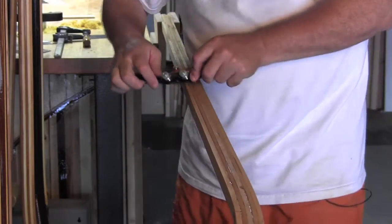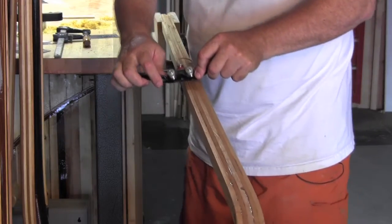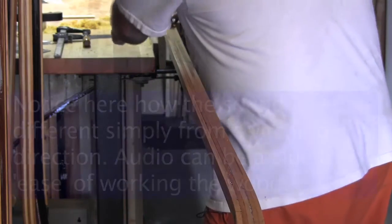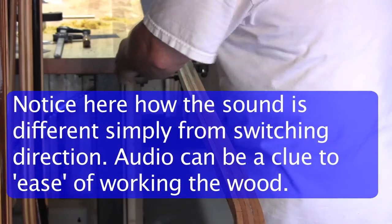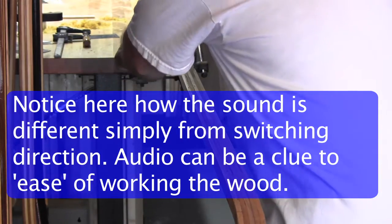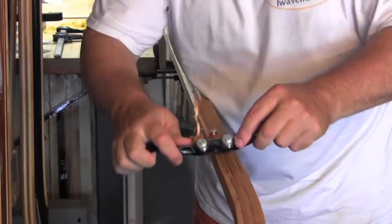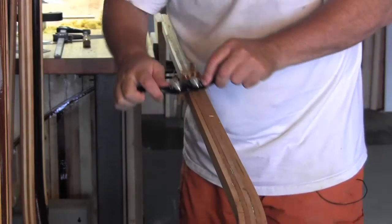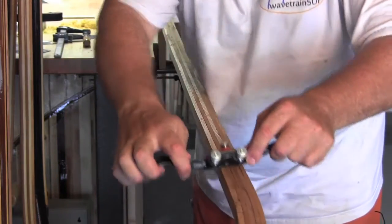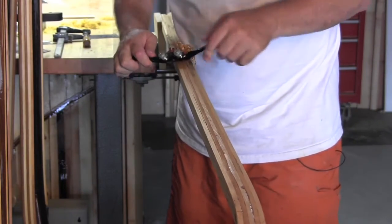The wood is not consistent — it has grain, softness, and hardness. The growth rings are hard and soft in a lot of wood. The first thing I always do is see if it feels any different going the opposite direction. Also keep in mind that if you are a big epoxier, you will encounter epoxy and that will feel different under your spokeshave. We'll use the block plane on the bottom piece of the shaft shortly.